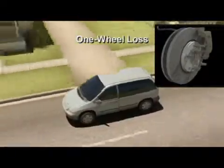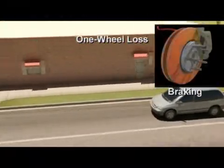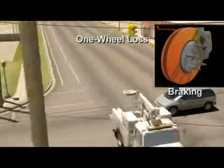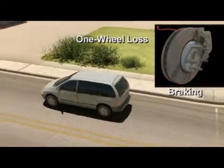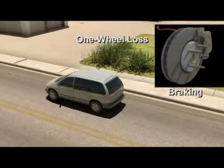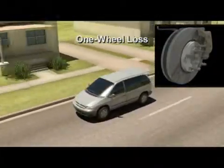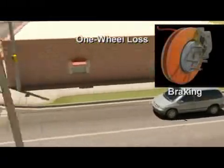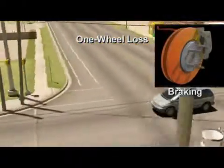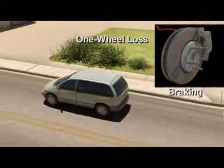As you can see, the brake hat continues to rotate while the brake disc remains stationary — this is the failure mode of a stationary disc. This loss of braking on one-wheel failure mode could increase the braking distance to 112.4 meters at maximum GVW, as compared to 63.2 meters for a fully functioning vehicle at 60 miles an hour. The maximum stopping distance for this vehicle per FMVSS 135 is 70 meters.